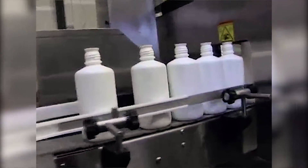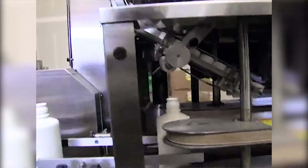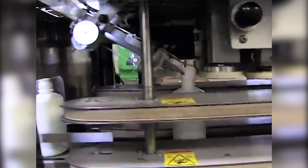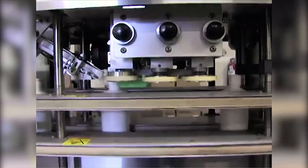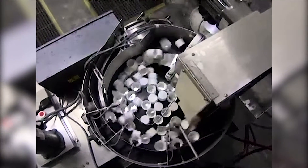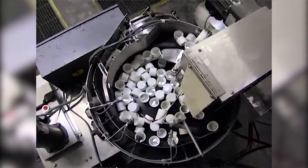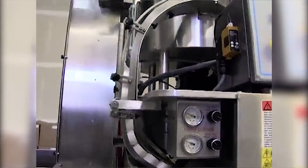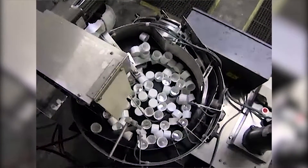The bottles then move on down the line to the capping machine. As they come through, the cap hits the tip of the bottle and falls perfectly straight up and down. Then it goes through this first wheel here where it's gently threaded on to get the bottle cap just right. The second wheel does about 90% of the torque to get it on, and the last one is the final amount of torque. By using high pressure air, as this thing rotates, only the caps that are oriented right will come out of the chute. The rest fall back in the bin and go through the cycle again, so you get all the caps coming out exactly oriented.